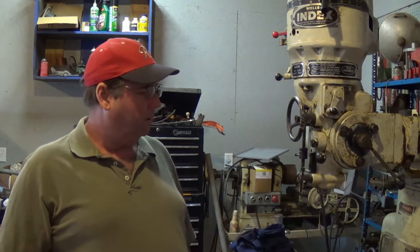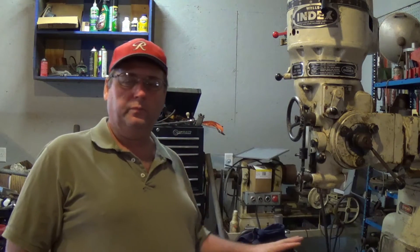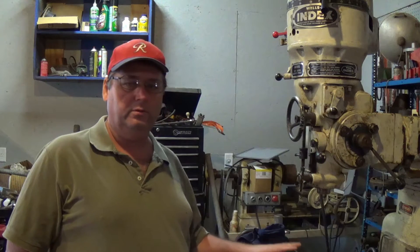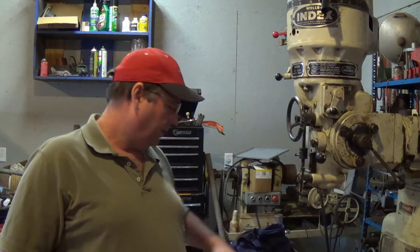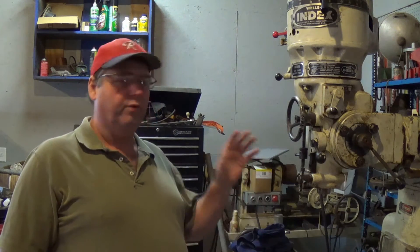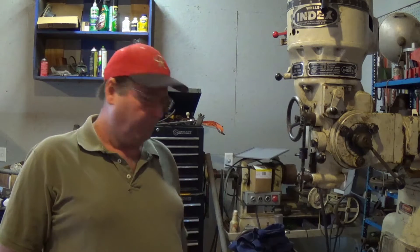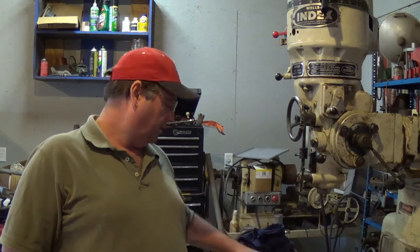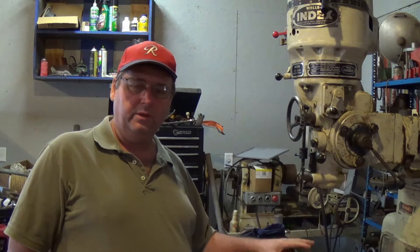What I'm going to do right now — since I had a surface plate still on the mill and I know that it's dead flat — I'm going to check the tram on my mill. It's been a little while since I've trammed it in, so it's probably going to be off a little bit. With the upcoming project we'll have to use the fly cutter, so I want to make sure we're as close as we can be on that.